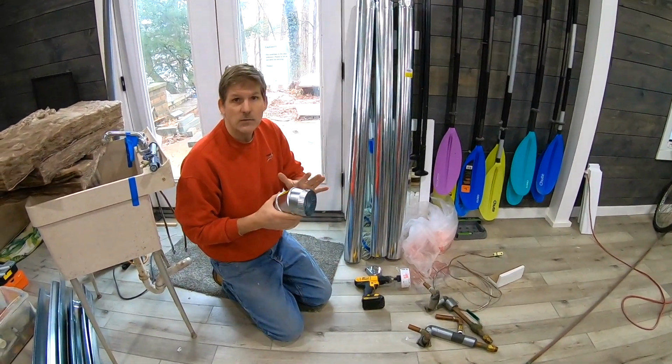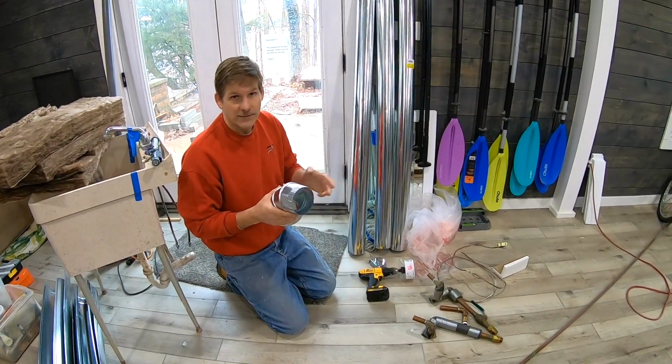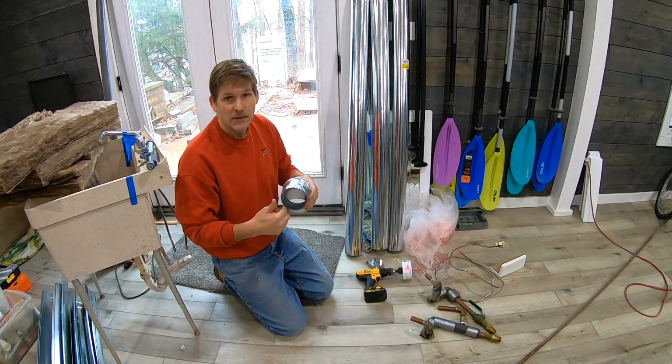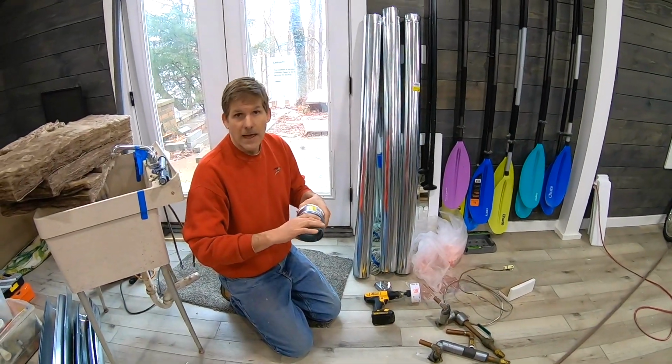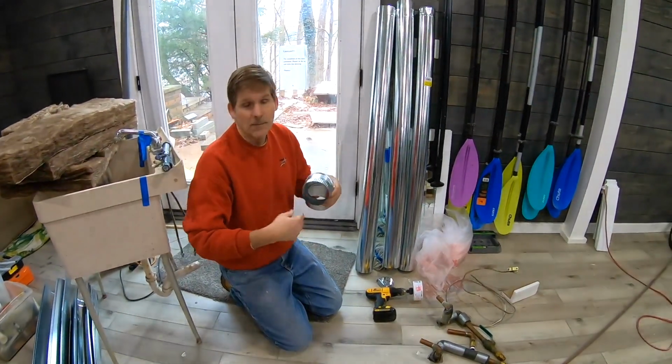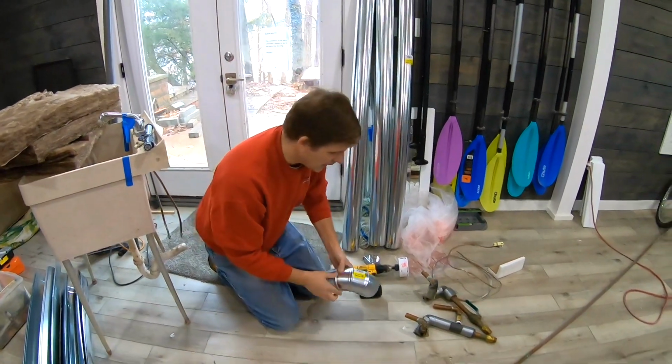We're not going to use screws. Screws catch lint, so all these are going to be taped, not screwed together, but taped with foil tape. The duct tape will fail with high temperature, and the foil tape is made for ducting at higher temperature.